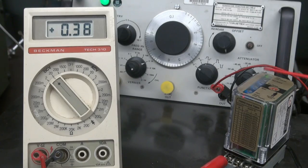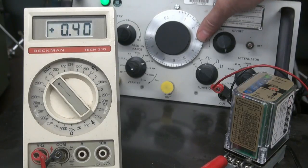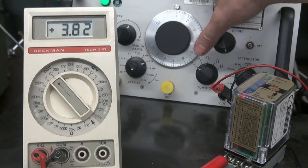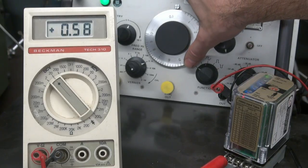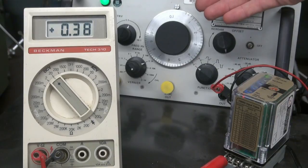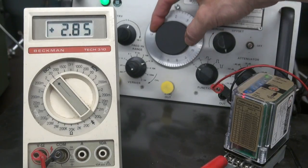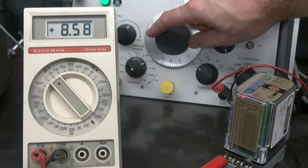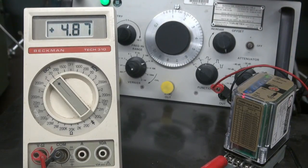So here's a quick demo of the API 7580G module with a frequency input, and I'll show you the voltage output, okay? This one's configured for about 0 to 6 kilohertz equals 0 to 10 volts. I'm on the 1K scale on my Wavetek. I'll start increasing frequency, and you'll see voltage increasing, okay? So there it is. She's swinging up to 10, back down to 0 volts. So if you envision audio sweeping from maybe bass notes, giving you maybe 0.6 volts, let's say, up to high frequencies, that'd be 8 volts, right? As your audio is modulating, this voltage is going to dance around. And that's going to make the CV input to a synthesizer very happy.